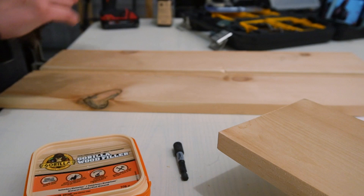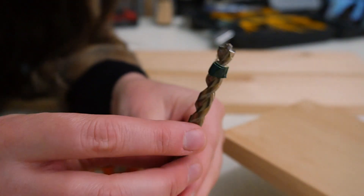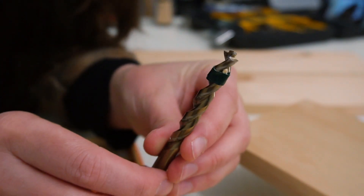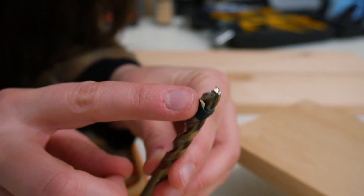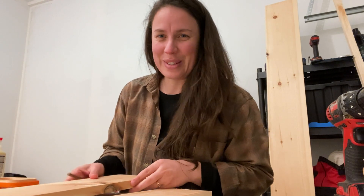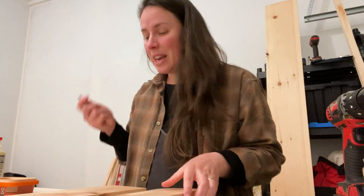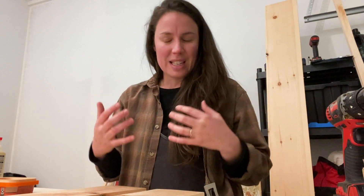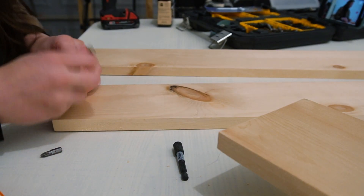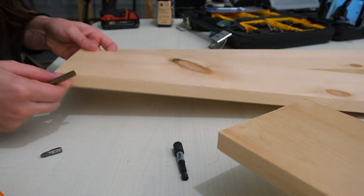So what I'm going to do is use this drill bit right here. I've put a tape around here so that it kind of tells me when to stop through the wood, and that's going to create my pocket. I'm going to use drywall screws. Basically, the point that I'm trying to say is you don't need all this special stuff — you just need to look around at what you have. Maybe you don't have all this stuff, but what do you have? You can pull it off. I know that you can. So let's do this little tricksy.